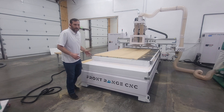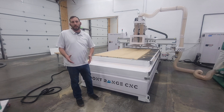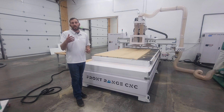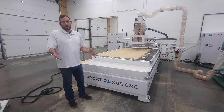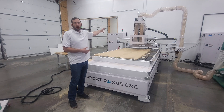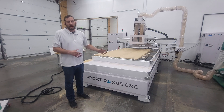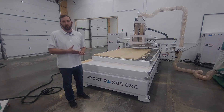Now that we've done those two things, it's about a two-minute process and you're ready to load the next sheet. You can combine this with loading and unloading setups to save those two minutes as well, along with automatic labeling. In an automatic label setup, we'll actually label the parts on one operation while the CNC is cutting, so you have almost no downtime. If you have any questions, feel free to call us or email, and we'll see you in the next video.